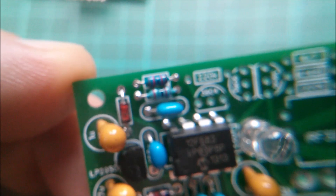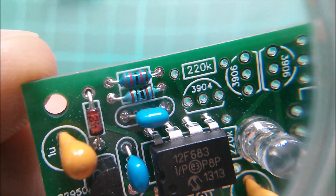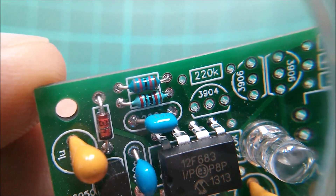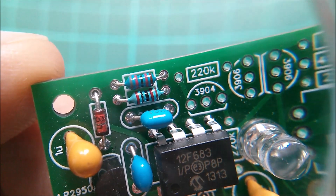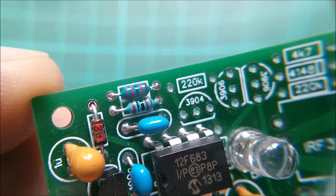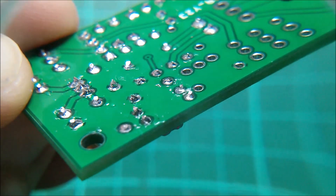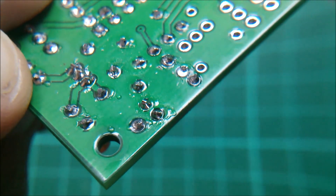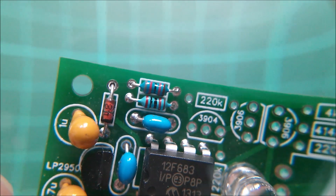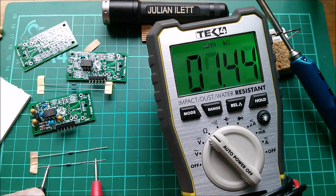These shades of red are wildly different — on the camera the 82k looks almost purple, and the 20k looks almost brown. I'm just going to put the resistance meter over these resistors to double check they are the right ones. The left-hand leg of the 82k doesn't look perfectly soldered, nor does the anode of the diode for that matter, but it doesn't really matter — you've got a cylinder of copper running down through the hole, and if it's soldered anywhere down that cylinder then you have a connection. You don't need a nice mound of solder at the top. So on ohms, let's try the 20k.